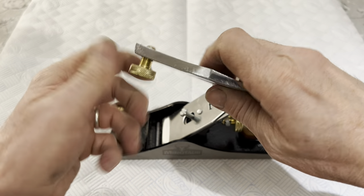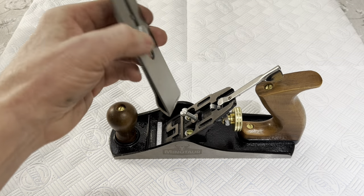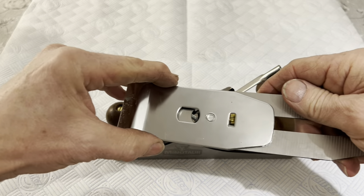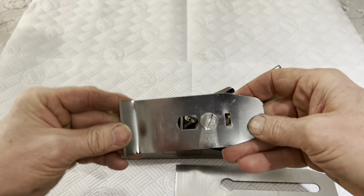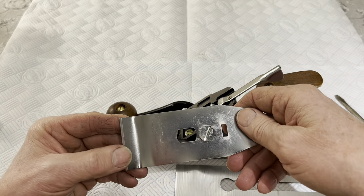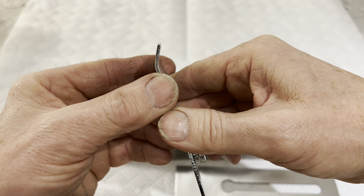The threads are quite free on it — it's relatively sturdy, it's light but it's steel chrome. The finish isn't the best but I don't know if that matters really. The cap iron is actually chrome steel, which I'm not too sure about because it makes it slippy. I've seen reviews where people say the blade is going back into the plane when they use it — it might be just that this surface is too slippy and not holding the blade. You could just rough that up with a bit of sandpaper. The end isn't sharp — it's quite blunt — but you'd think it'd catch the shavings and it doesn't.